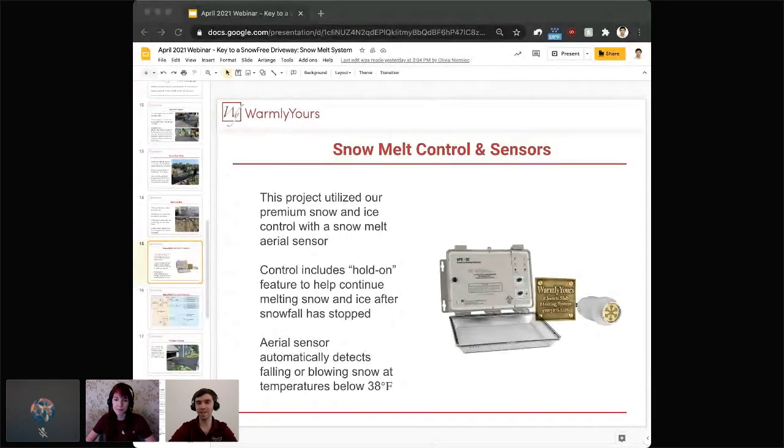The way you answered that slide is actually you answered additional questions that we had from Chip. His question was, how is this controlled, and is it a thermostat? As you just heard from Lynn's description, it's not a thermostat. It's a specific snow melt controller that utilizes an additional snow sensor. Because first of all, you don't want to control the system just by a temperature. You don't want to maintain some temperature like your floor heat, or trigger the system based on the outdoor temperature.